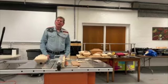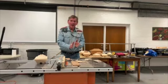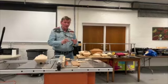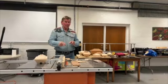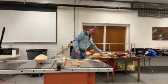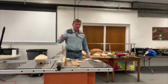You won't know what angle to cut it at. You take the reading for those dados from whatever angle you cut the box at. Now, if you've already cut a box and you're going to use the same spacers, now you have that reading, and yes, you can. If you haven't cut a box yet, then no, you can't, because you need that angle. Once you've cut one box, if I wanted to keep making this box, once I have that angle, I could pre-cut that on all of them.